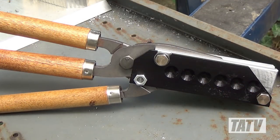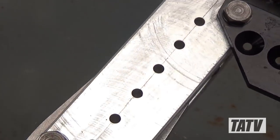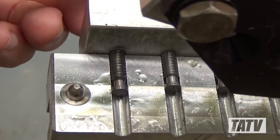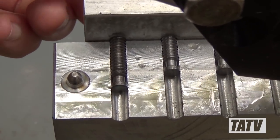The mold you see here was custom made for this purpose using a standard Lee Precision blank. As you can see, it takes a 6-cavity handle set and includes a sprue cutter, making it simple to use. Below each cavity is an adjustment screw, which is used to control the size of the cores, allowing for a wide variety of different bullet types.